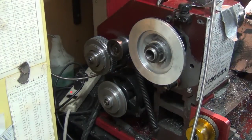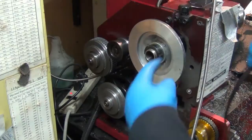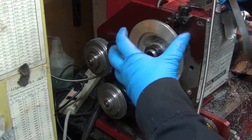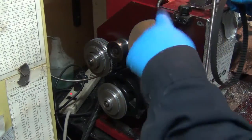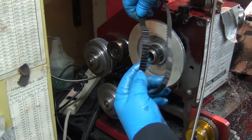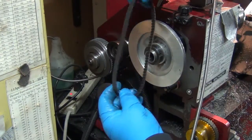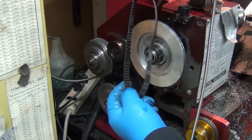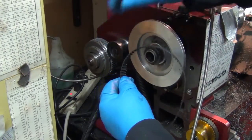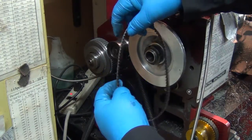After that bad crash the other day, something I should have checked but didn't was the belts. I thought the squeal was the smaller, thinner belt, but I think it was this one — I chewed some teeth off it. It's been running fine under light load, but now that I'm trying to cut something heavier on these bearing adapters, I was getting a really bad bump at the top. It was jumping bad.